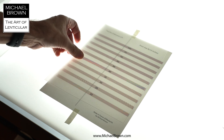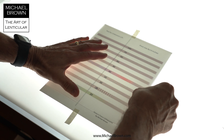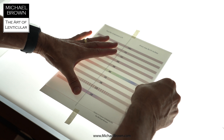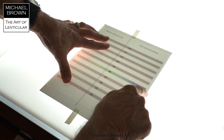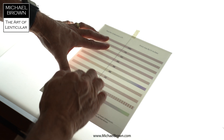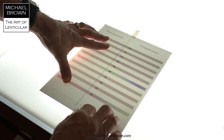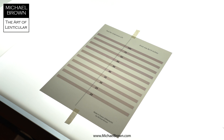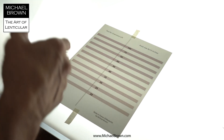I'll take this first sheet and put it on the chart and I'm going to rotate it so this black line is solid from top to bottom — which it is right there. When I look at this, the most solid band is 40 LPI. It's not completely solid; I can see from my standing position a blue band and a red band, but of all of them that is the most ideal. That particular sheet's 40 LPI actually pitches to 39.922, and that's why you didn't have the solid line.